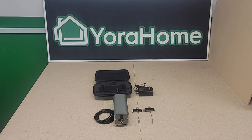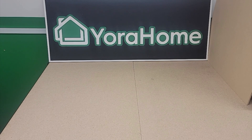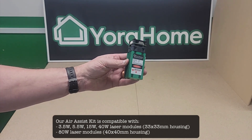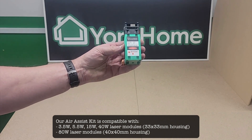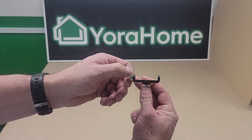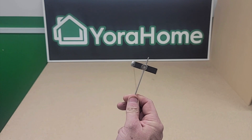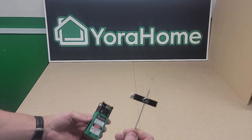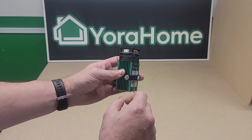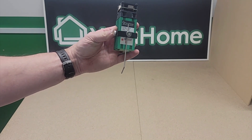Now I'm going to show how to install the nozzles on each of the diodes. For nozzle installation on the 80 watt diode, I have the module removed from the machine for convenience — the application applies whether it's attached or not. On the clamp itself, there's a thumb screw on the side that will tighten it to the module heat sink, and another thumb screw that adjusts the height of the tube. You simply place the clamp against the face of the heat sink and tighten the thumb screw accordingly to hold it firmly in place.